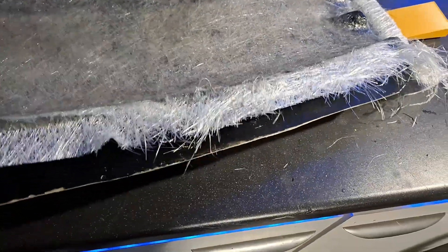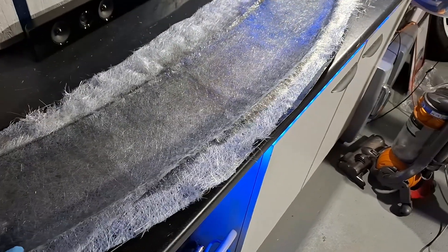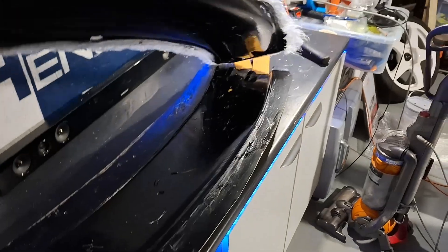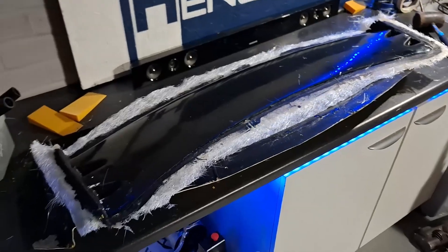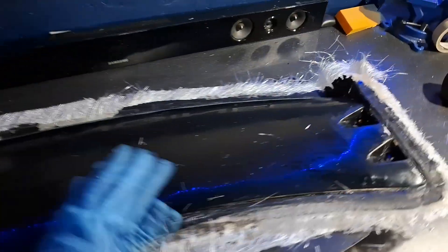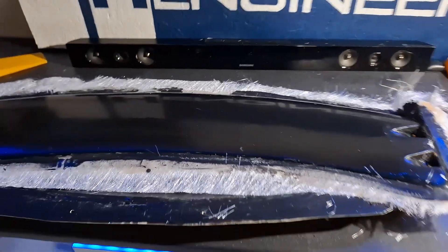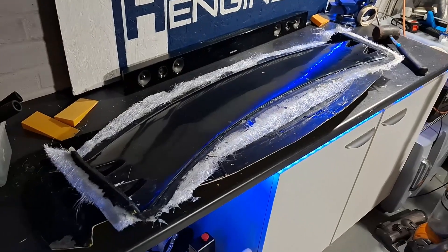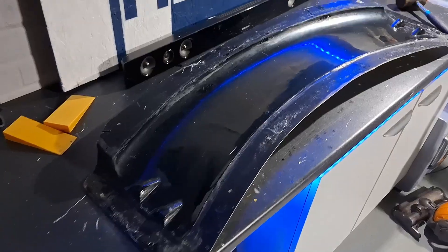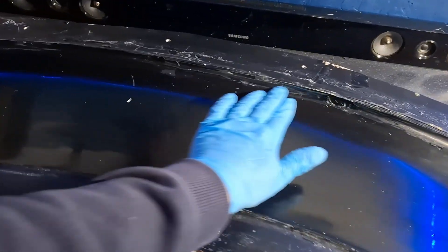It's always good to try and propagate a crack along the edge. If you're too aggressive in only one spot you can really separate the glass fibre from the gel coat and it creates a big old mess, so I'm doing my best to follow a crack from one end all the way to the other. Lifting that part out of the mould — a little bit of pressure with those wedges on the opposite end and I can lift that bad boy away. Let's have a look at the surface... check that out. It's just like a mirror. I couldn't be happier — that's ace. I've got the divots where I want them for the bolting that will go on later to the strakes and end pieces, and the detail seems to have come up really well. The mould hasn't fared too badly either — I reckon I've got another couple of shots in that before I have to rework it.